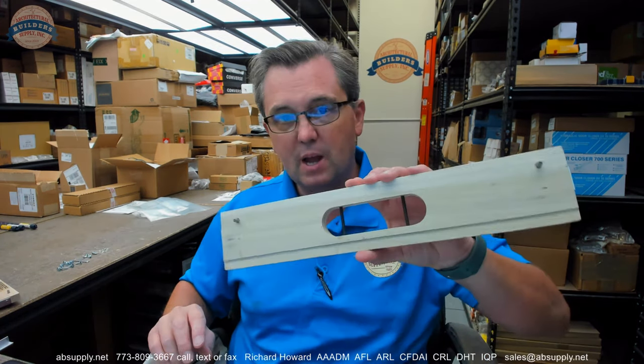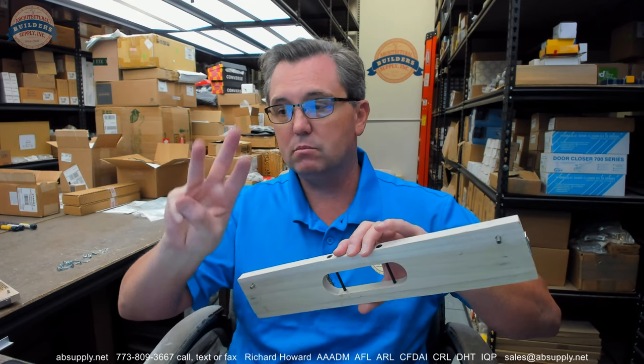So based on my quick calculations with the material that's here and included, you'll be able to do doors that are up to 7 foot. If you were going to need to do 8 foot and taller, you're going to need to order another template because you'll be doing four hinges on there. And you'll have to order it to be sure that it's routed for the channel, because the standard template does not, I don't believe, include that routing, as I've said earlier.